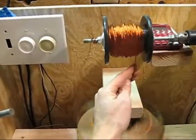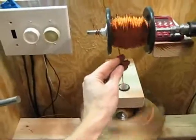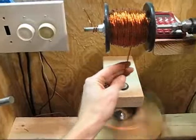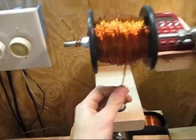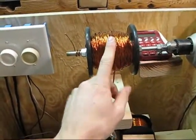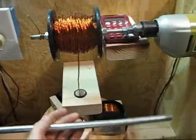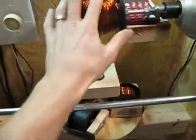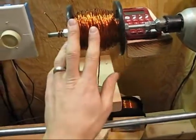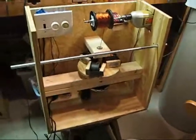There you go. And that is basically it. I never wind the twisted wire directly onto my final coil form. What I do is wind a nice sloppy one like this, then stick it back on my main bar going across here, slow this motor down, and wind a really nice one for my final. So that is basically the coil winding jig.